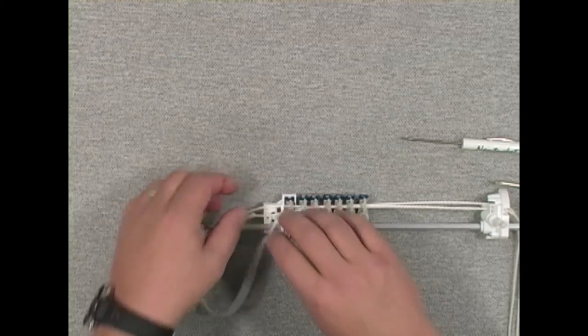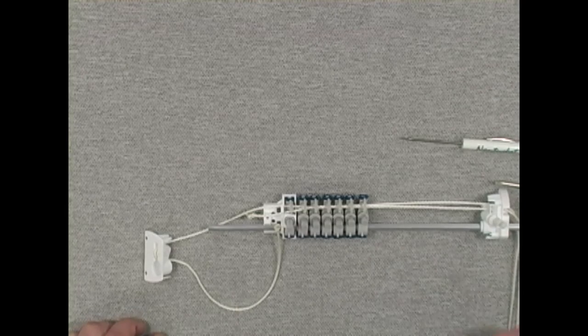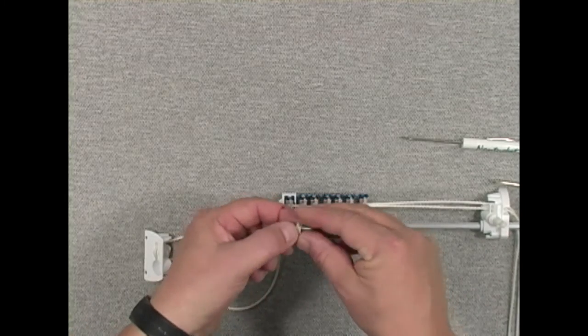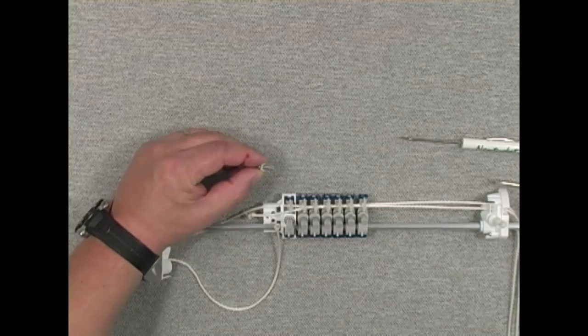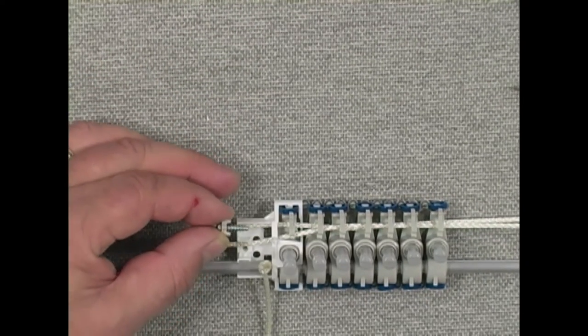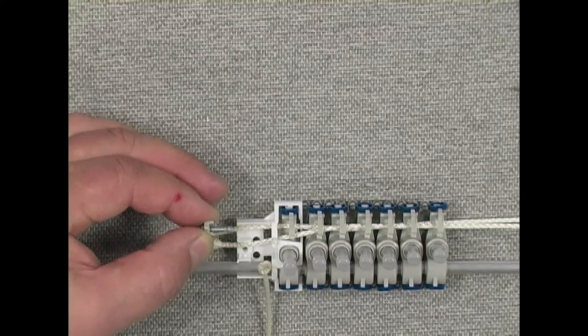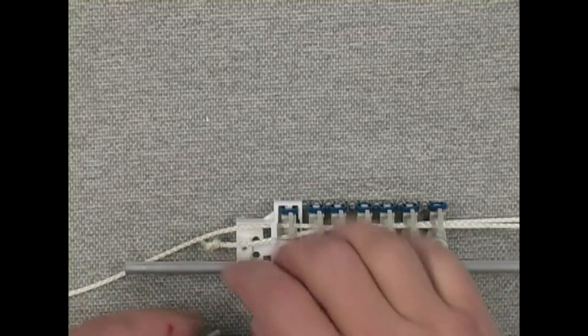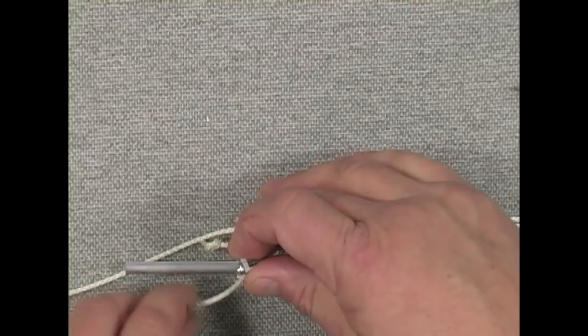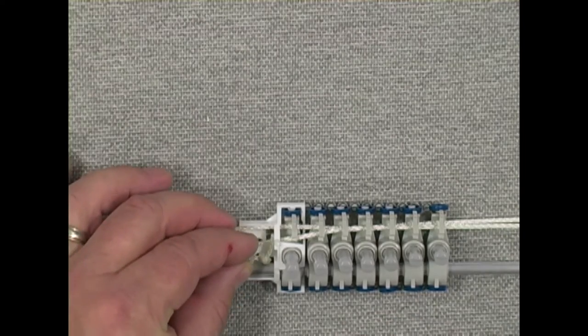I'm going to go ahead and anchor them so I don't lose control of that. And where's my anchor screw? My anchor screw has these two features on the plastic portion that come down and directly squish. It fits into this feature here. And these two features on the outside here squish that cord into place. It holds on to that. So I'm going to go ahead and anchor those guys down. I don't want to lose control of them. I don't want to have to deal with that again in this assembly.